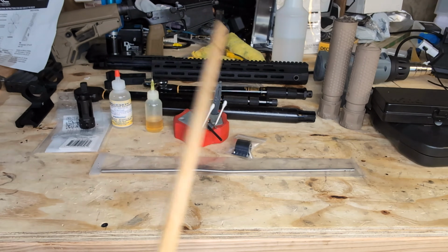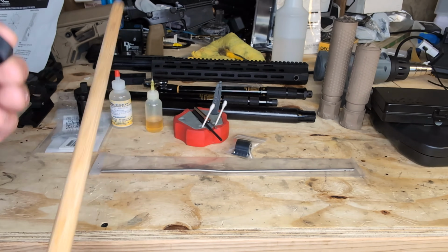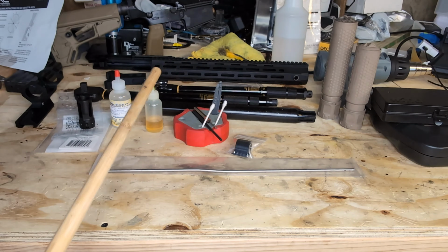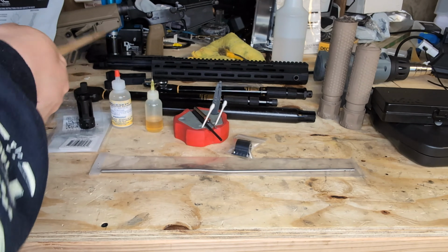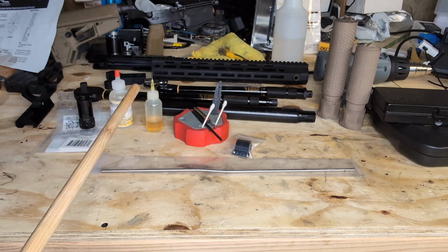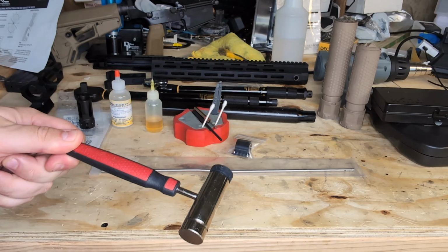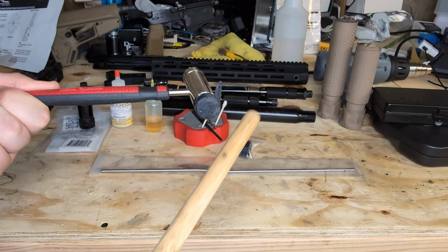That's going to go through the most extreme of the heating and cooling cycles of your gun, depending on your schedule of fire. And then some cotton applicators to put that on the inside of the upper receiver. And the reason I'm not touching it is because I've preheated it already. So yeah, I'm not going to touch that. And then other than that, hammer for the roll pin, and then with a rubber insert installed.